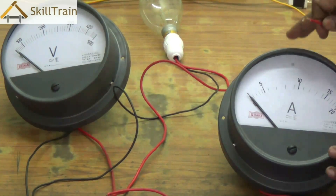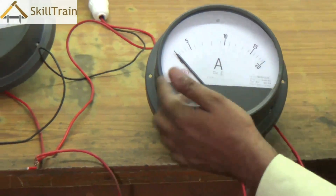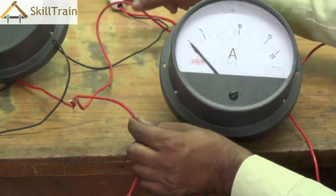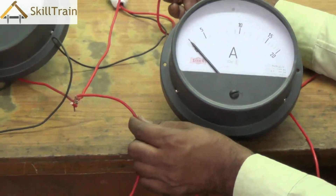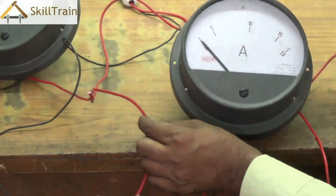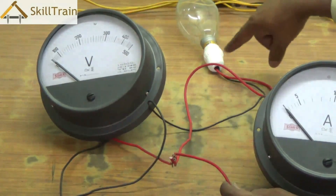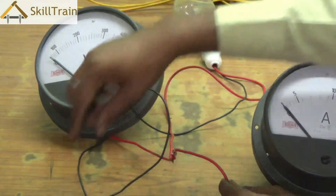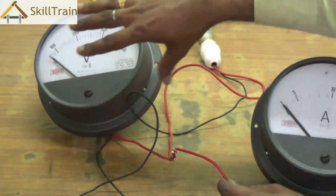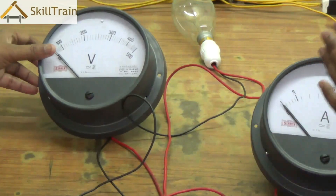Let's take a look at the entire circuit once again. One end is connected to the mains phase. The other end of the ammeter is connected to lead 1 of R1. Lead 2 of R1 is then connected to the neutral point. The voltmeter is connected to phase and neutral directly — the phase is connected to the phase of the voltmeter and the neutral is connected to the neutral of the voltmeter.